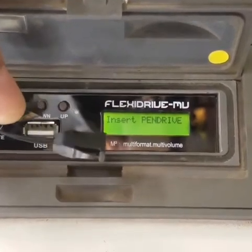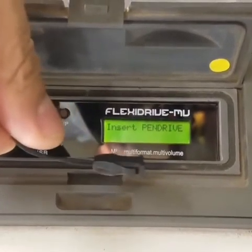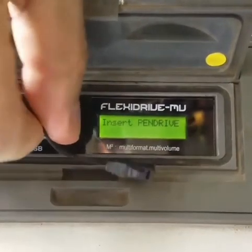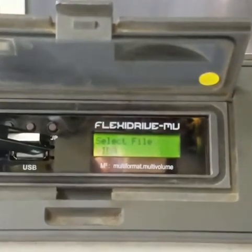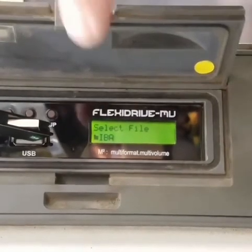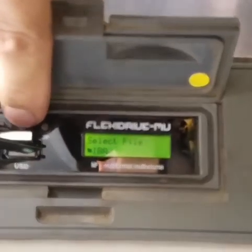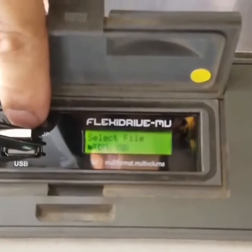Very. It says the file must be named okumamv.cfg, and it has to be right there in the root directory, not tucked away in some folder. Gotcha. okumamv.cfg, top level. Okay, drive is in, file is ready. Step 7. Now, you use the UP or DOWN buttons. The guide doesn't specify which numbers these are, interestingly, just UP-DOWN, to find and highlight that specific file, okumamv.cfg. Makes sense. You might have other stuff on the drive, but you need that one.